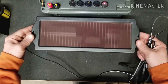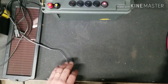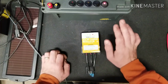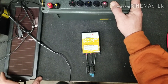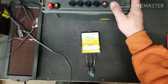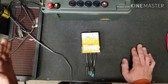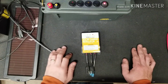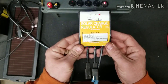For demonstration purposes only, this is a one and a half watt solar panel just to get the point across. You're going to need a solar charge controller. If you do not have a solar charge controller, you run the risk of damaging your batteries — whether it be overcharging them, or if your panel doesn't have a diode built into it to protect against back draw. Your solar panel can actually draw off of your battery instead of charging it.